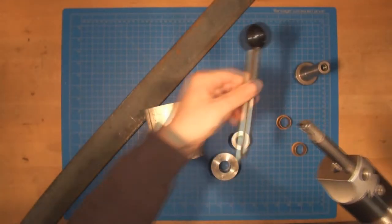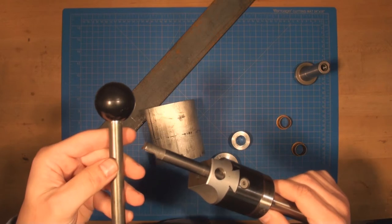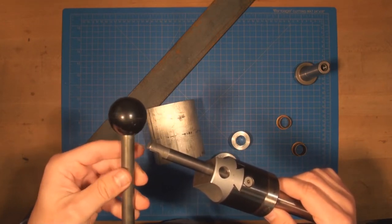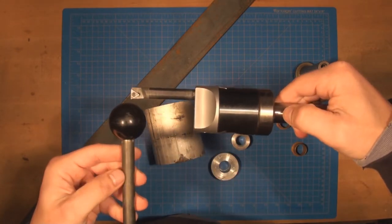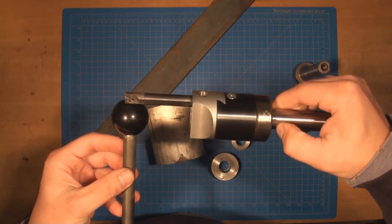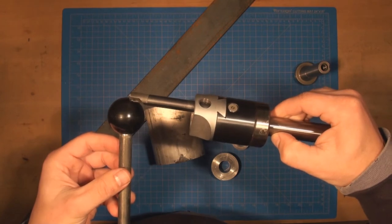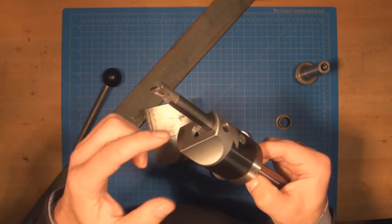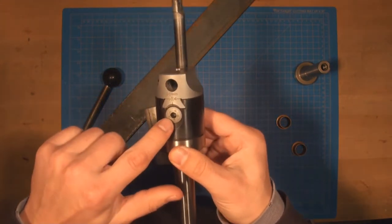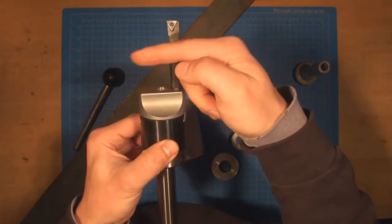And if you imagine, this is a piece of aluminum resting in a lathe chuck, and it's spinning, like so. The boring head comes in, and while it's spinning, I can move the boring head and basically create any size of sphere within a certain limit here. So if I turn this screw, the boring head is going to move right or left, so the tool is going to move in or out.